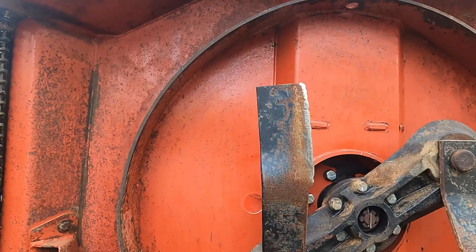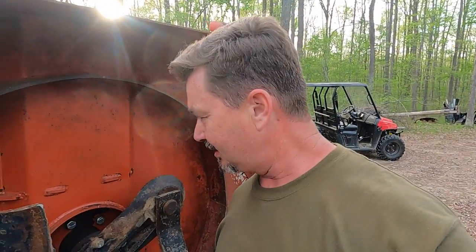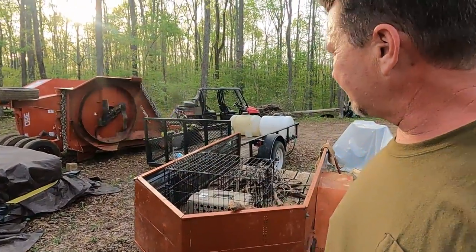That'll do. I don't want to eat it down too much. If you go too tight in there and make it too sharp, it's going to get thin in that area and it's going to get brittle and it's going to break if it hits a rock. So I believe we got it plenty, and I think it's going to cut really great. Of course, I've still got to get the belly of it done, but we got both sides.